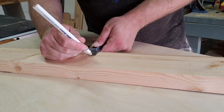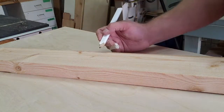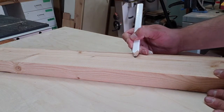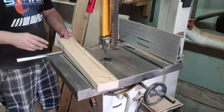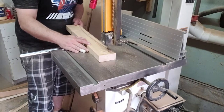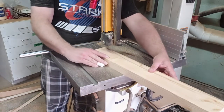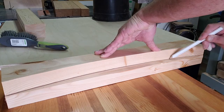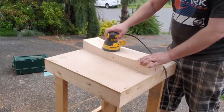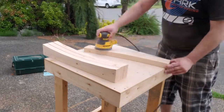I'd say they ended up about 25 inches long — roughly 32 minus 2 minus 5. Then I got overly fancy again, cutting a little curve in the aprons. I drew it by eye, set a center point, freehanded a curve — about an inch in on the bottom — then cut it out. As long as they're all approximately the same, that's all that matters. Then sand, make that curve nice and even, and do an initial sanding on the stretcher pieces as well.